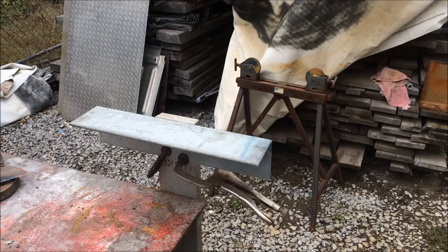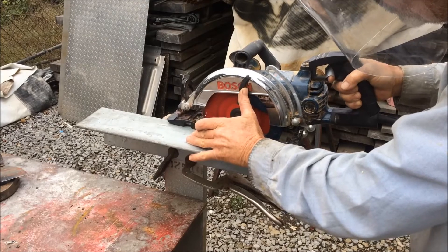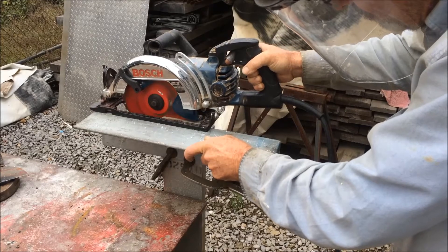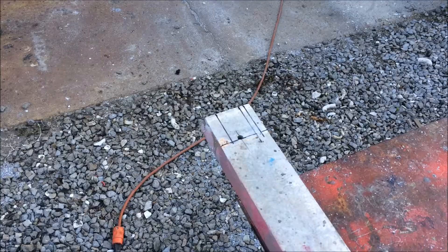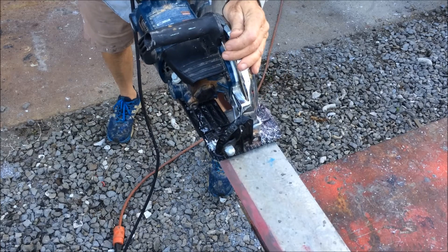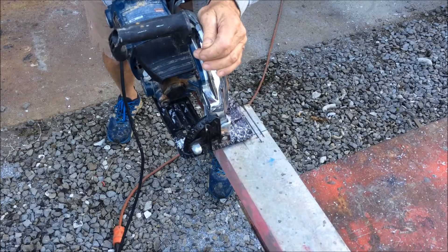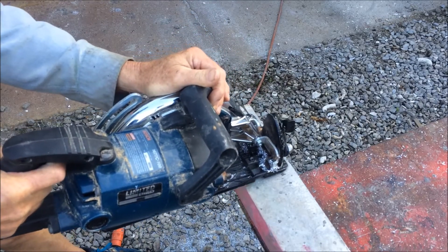I spent a lot of time trying to make the new one-inch corners fit into the existing aluminum structure. I wanted to maximize my inches of weld between the new part and the old part. It wasn't square, it was sloped, it had bevels, and I probably didn't have the right equipment — I'm sure the skill saw is not the method of choice for a fab shop. I kept pecking at it, tried different things: the jigsaw, the skill saw, ended up using the port-a-band a little bit. Eventually I got them all to fit and got the most number of inches of weld to make this thing as strong as possible. The plates will have a lot of inches of weld too when we deck it out, so I think it's going to be stronger in the new larger size than it was originally.